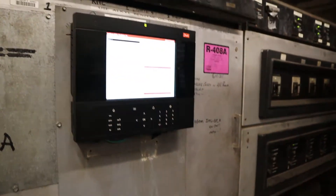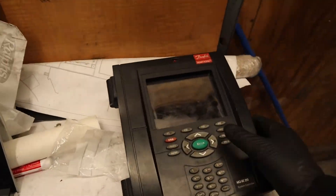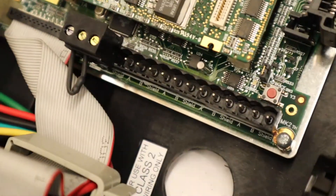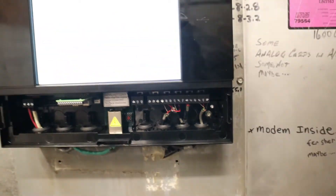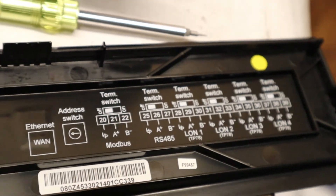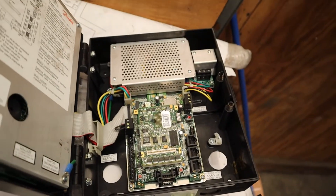You have to verify everything, watch it, no new alarms. These are existing alarms, so I'm not too worried about them. Every board's online, all the temps are good. Here's the old 255 right here. One thing I do want to point out is for the IO network right here, the wiring is very different. You see how it goes B, shield, and A? On the newer 880s you're going to have to rewire it. The shield's actually in the beginning — it goes shield, A, then B. So you have to rewire everything. You can't just unplug it from the old one and plug it into the new one, or everything's going to be offline.